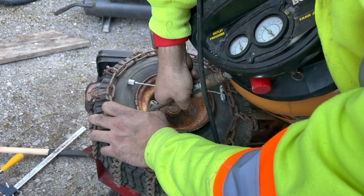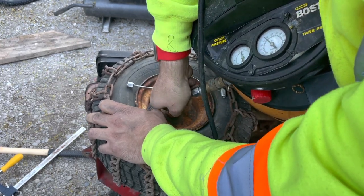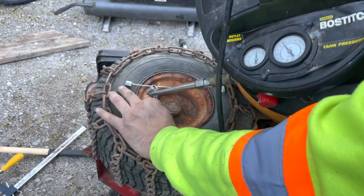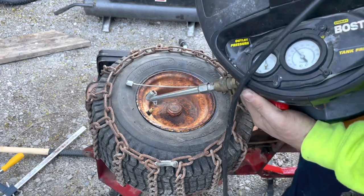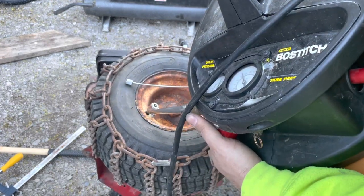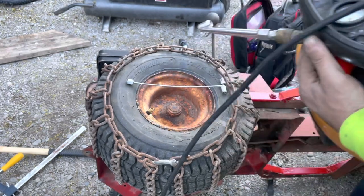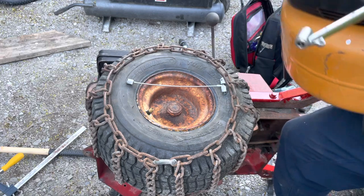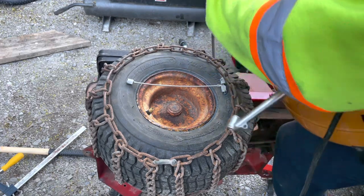You can't pump these tires or the tube inside the tire up to normal pressure — like 20 pounds or whatever the tire was rated for. I only put about five pounds into the tire just so it's still soft but firm, and that worked out.